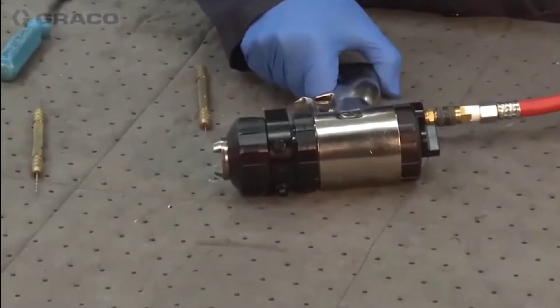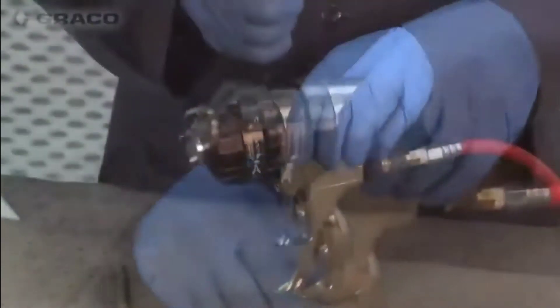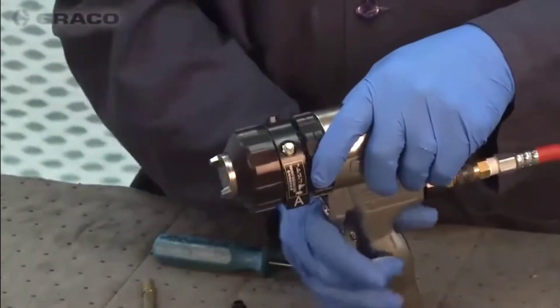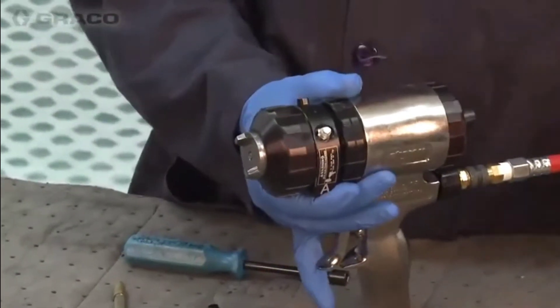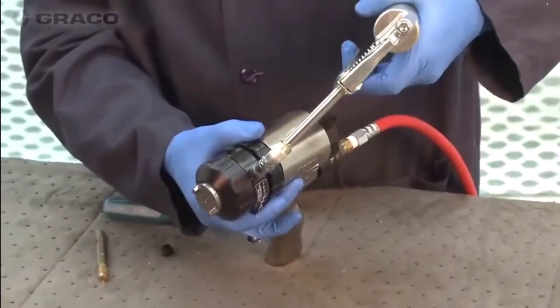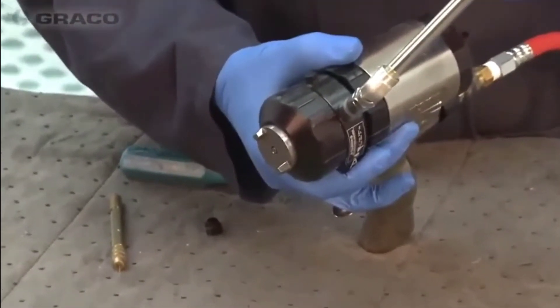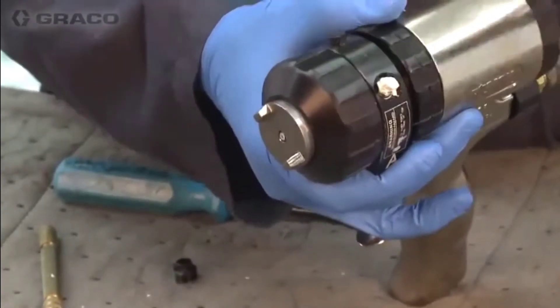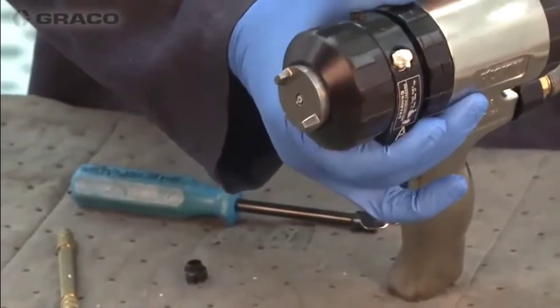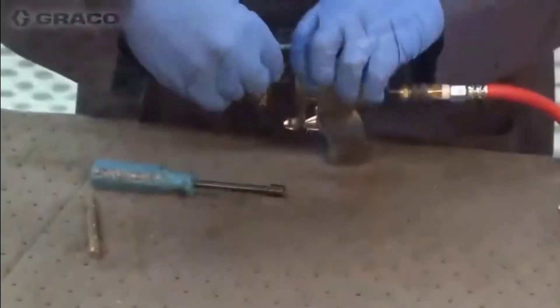You can start the purge air. What we want to do is open the grease Zerk cap and give it one or two squirts of the iso grease. We just want it to mist out of there — we don't want to pack that mix chamber with grease. Two shots. Then turn off the air and return the cap.